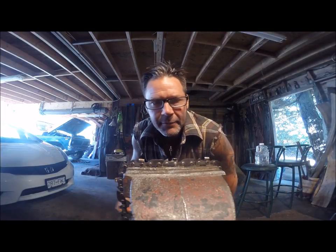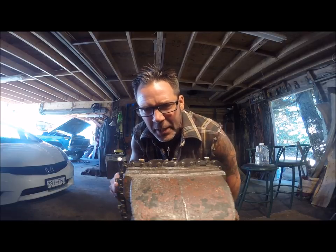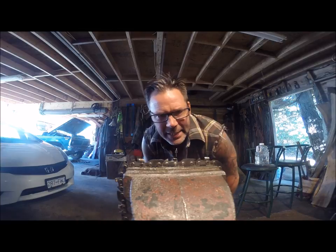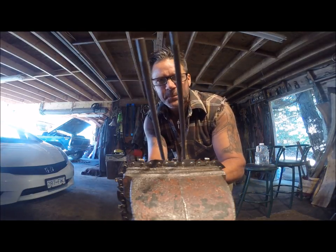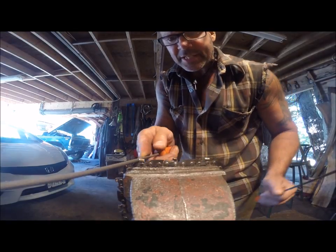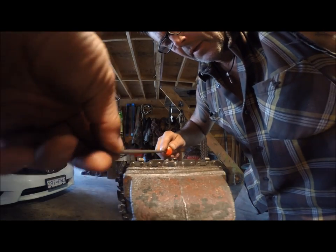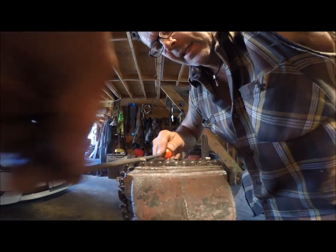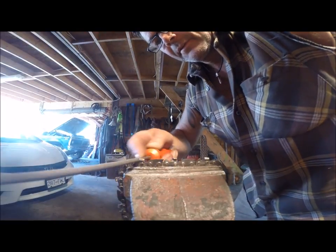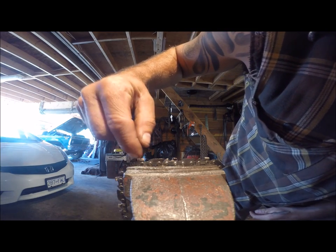Okay Synth, I've made an executive decision on your chain. We've got to get a hook in it. This is a gas-powered machine and I might even customize this a little bit for you. I'm going to use a fatter file — see the difference here. This is what they call for, 5/32nds, and it goes in nice. But so does this other one, and what it'll do is dig out a gullet. You can actually see it's gone down quite a ways into the tooth.